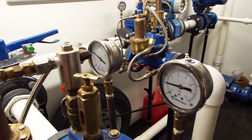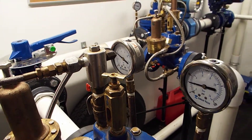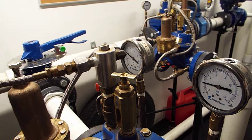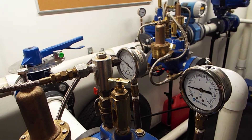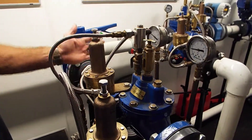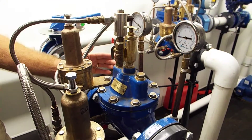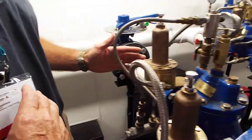Now, this system is putting out 50 PSI, about 100 gallons a minute. So if somebody went in there and turned it like 15 turns, you're going to bring a main out of the ground — you can easily do that. Just by this simple adjustment of the screw. Now, that's a pressure-reducing valve. The idea is I have 50 PSI upstream, and my customers downstream only want to have 25. That's how I handle that — just by this one pressure-reducing valve.